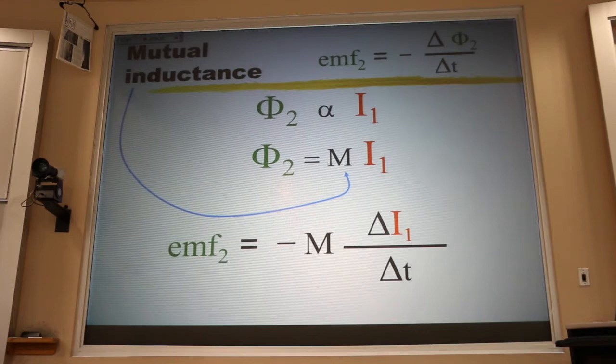It turns out that when you're moving current across, say, a desert, you lose a lot of your power. Twinkle, twinkle, little star, power equals I squared R. And so the bigger the current, the more power you're losing. So they find that if they send that power across at very high voltage, they don't need very high current to get the same power. And so they send it across at tens of thousands of volts.